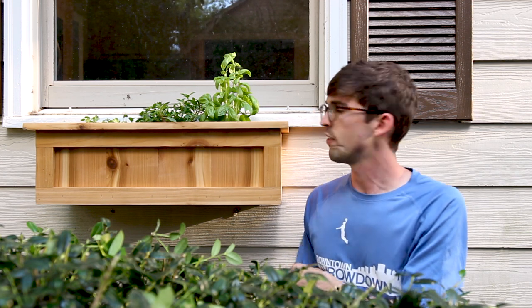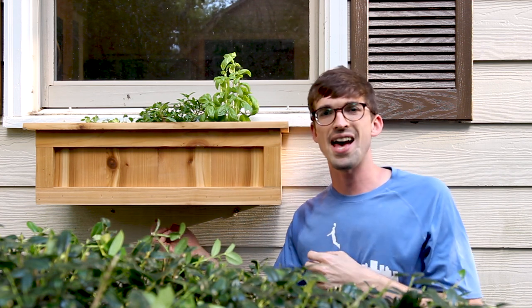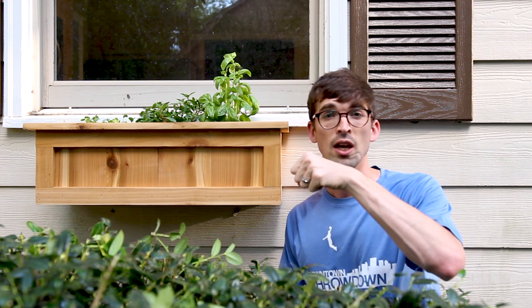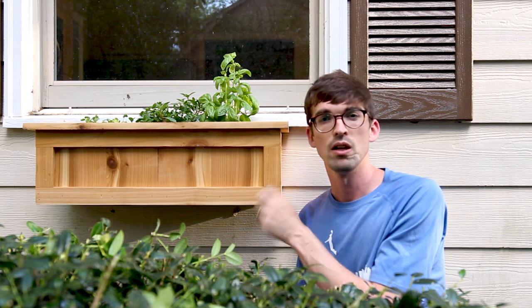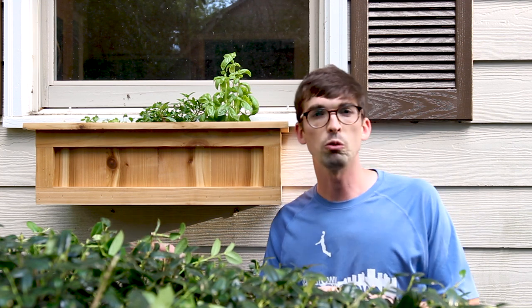A couple other things: the drainage holes. I did drill holes, but I forgot that the actual insert already has holes built in, so I wish I had lined those holes up. There's still a gap so the water will eventually make its way out, but I wish I had lined them up to make it a lot easier. Overall, pretty easy project. I used my nicer table saw, but really if you guys just had a circular saw you could have made all those cuts. I wound up getting this cedar from Home Depot in the 70% off lumber area because it had some pretty nasty knots — so this probably cost us $15 when all was said and done. This is the very first video on the Make or Break YouTube channel. If you guys like this, make sure and hit subscribe, give me a thumbs up, and leave a comment below with the herb that you use the most in cooking and which ones we should have planted right here. Hope you guys are doing great and we will be back soon with another project. See you guys.